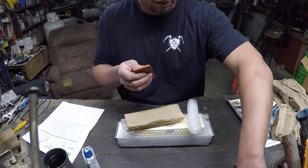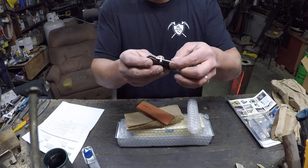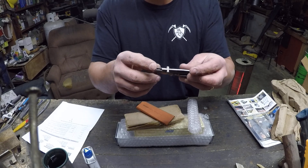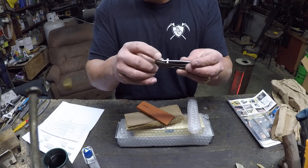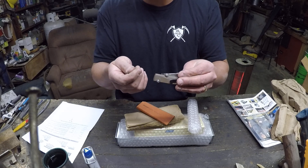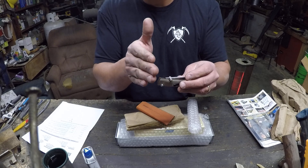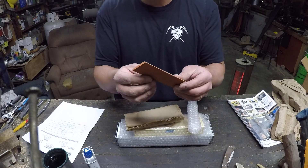Here's one of my toggle locks. The notch inside the blade — you cut that pretty close to fit before heat treat, then you use an anti-scaling compound, dip the blade in that, and go ahead and heat treat it. It does a fine job, but there's always that last little bit of nastiness inside that notch that's tough to clean out. Most of the time I just wrap some sandpaper around a small file to get up in there, but the sandpaper flexes on the file a little bit — so having a couple of these stones should really help out with that.